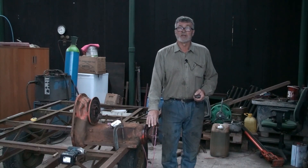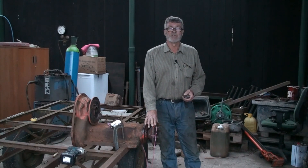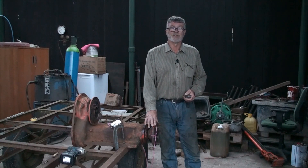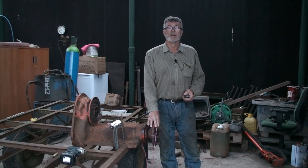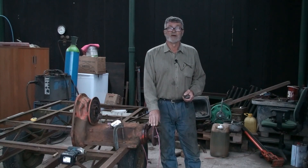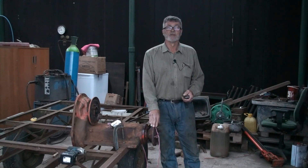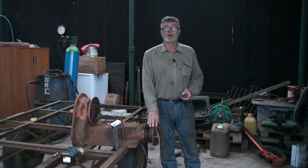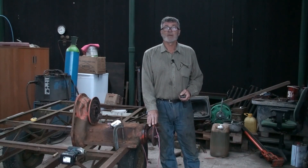Do remember this is a 460 flange with the six stud pattern, used on the 460s, 1060s and the Universals before it - similar diameter to the 502. If you've got the largest stud pattern the force required is less. These figures are for used bearings; the figures for both are slightly higher if you're putting new bearings in. Hope you've enjoyed the video - happy tractoring everybody.